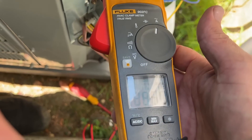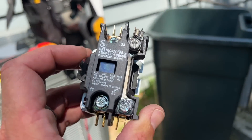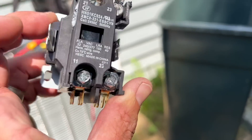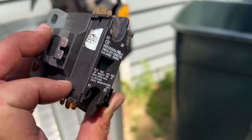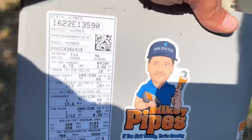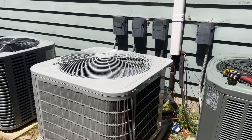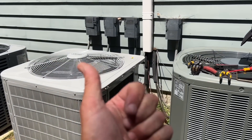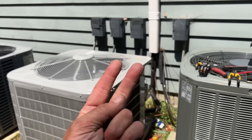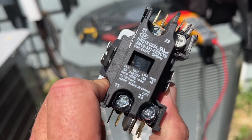Common is at 6 amps. So it looks like in this particular case the contactor was the culprit. Defective contactor on a brand new machine — incredible. Full disclosure, there's the model and serial number — just installed about two months ago. We did our due diligence, verified the problem, made corrections. Hopefully this doesn't happen again. Maybe it's made in China? Yep, sure is.